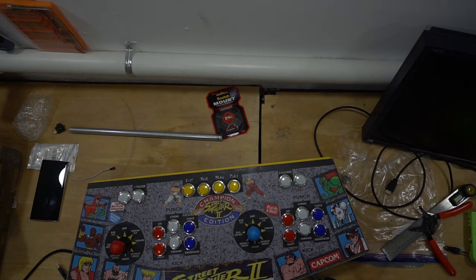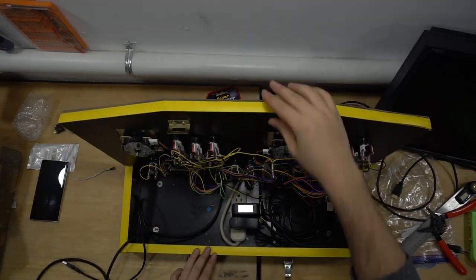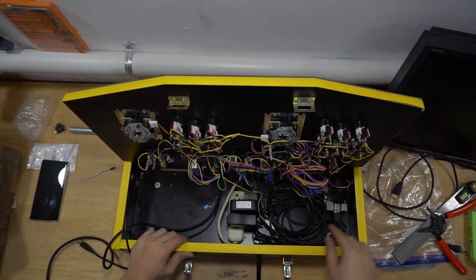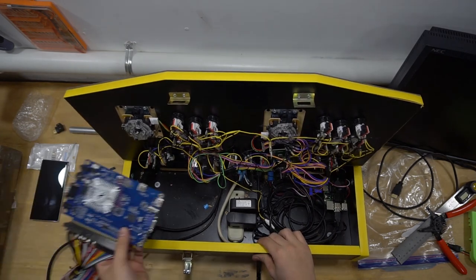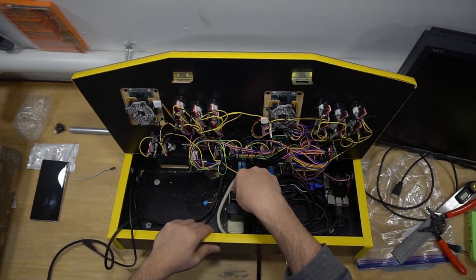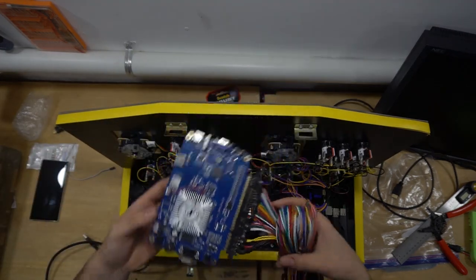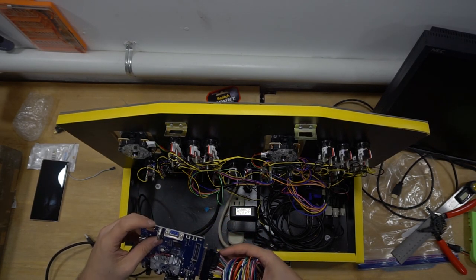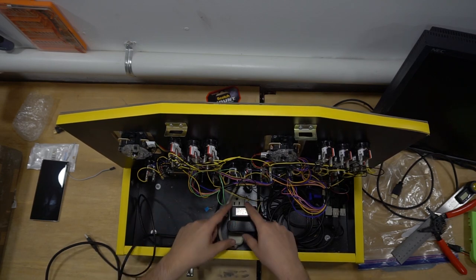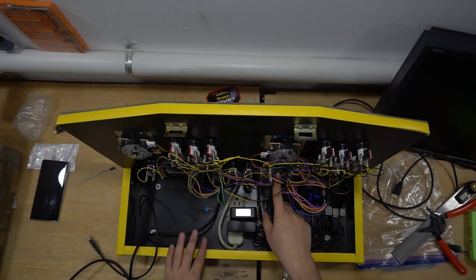I never tested the drop-down overhead camera, but real quick we can show you exactly what's going on. I already modified some stuff, so if I open this up you're going to see a couple of things. We moved things around - the big thing is that we have our Raspberry Pi here and now our Pandora's Box is going to fit right here. The original setup was a little wonky. Game Room Solutions had the Zinmo controller dead in the middle, which is a good spot, but it didn't work for us because our Pandora's Box board needed that space. We had to move the power plug to dead center so these are the only two tall pieces, and the lid can drop down with no issue.